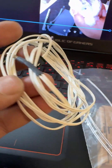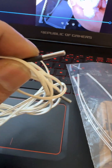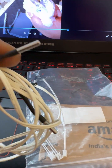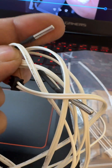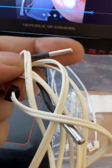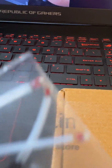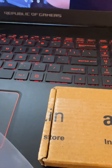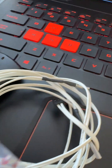In the previous video, one thing I forgot to mention was about these thermistors — NTC 100k. They come in two shapes or two sizes: this is the cartridge type as I earlier mentioned, it's a 6mm length and 3mm diameter. And then you have these glass probes. Heat blocks are different for these two applications.